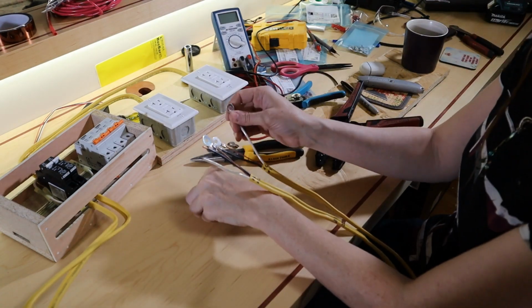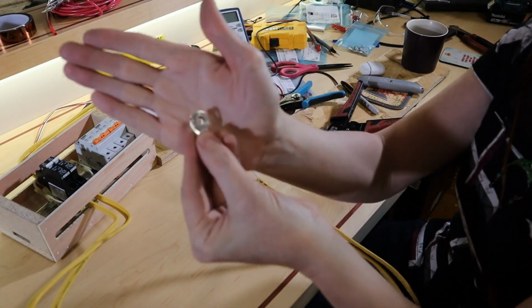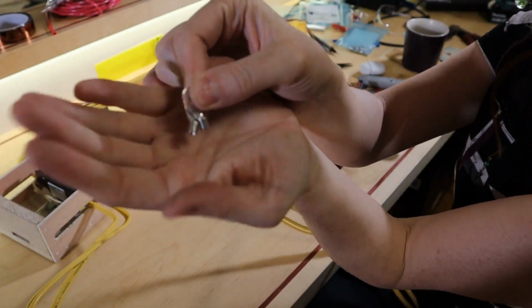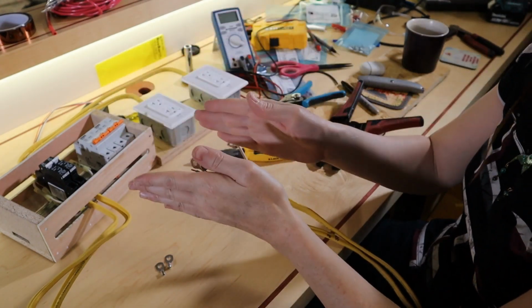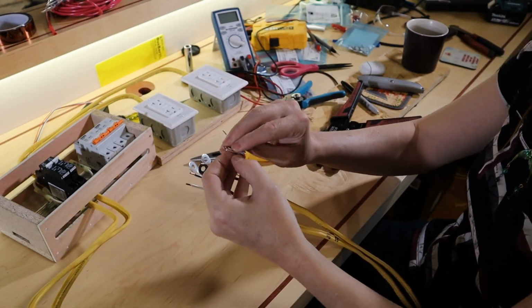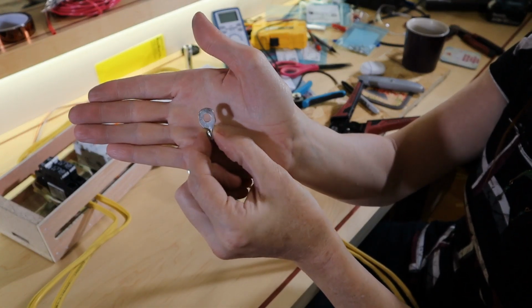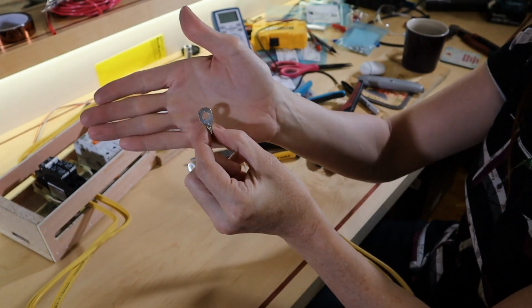Now, something I need to do is pay attention to the angle that I attach these ring terminals. If I put them so that the barrel is up on both sides, then they have to sit slightly crooked over one another, so the sides I shaved will be kind of pointing over. If I do them back to back, then I can keep the shaved off sides in parallel, so I maintain the maximum gap between the positives on either side.